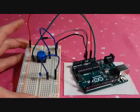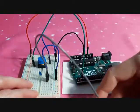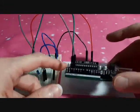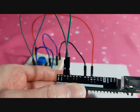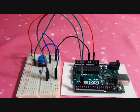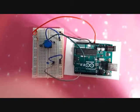See how it's on the same line? And next we put the jumper wire on the positive, and that's going to hook into the Arduino on pin 3. So you have the button on 2 and the light on 3. And here is what it looks like from the top. And onto the code.